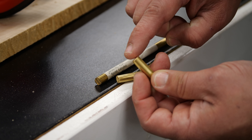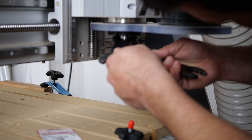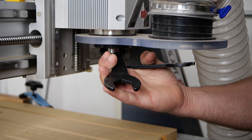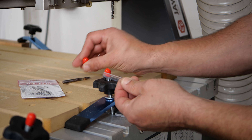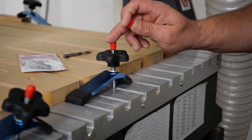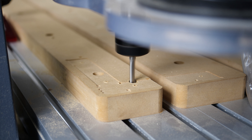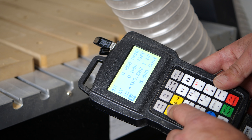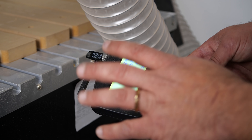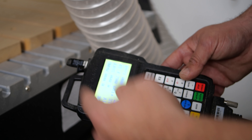Once we get those all placed, we go into the Manufacture workspace and create the G-code. In the Manufacture workspace, we do our first setup. It's important to put your origin in the bottom left-hand corner — that's where your CNC machine origin stays the whole time. Our first toolpath is a 2D bore toolpath, a simple toolpath for creating holes. We pick our bit — a quarter-inch downcut bit — and select the bottom two holes. This is your spoilboard toolpath. Then we re-bore our holes, reset Z height to our material thickness, and cut all four holes. We go back to the model workspace and draw a sketch rectangle as our limiting area for the first template-cutting toolpath — I draw it two or three inches above my locating pins.